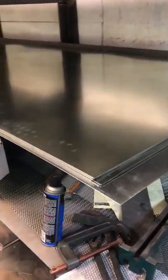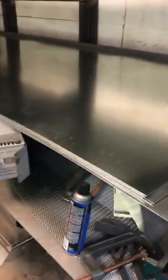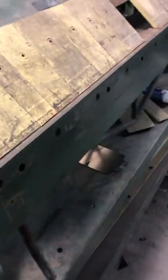My sheet metal rack cost a little bit of money for the four-inch angle iron. It's got about 20 sheets of metal on it right now, and also a bunch of crap. And then a little four-foot box and pan break I paid $100 for — you've got the other fingers you can throw in there to set it for whatever size of box you're going to bend up. It works really well.